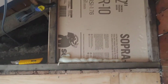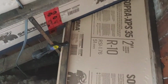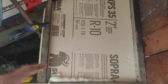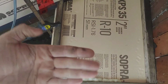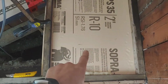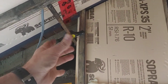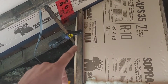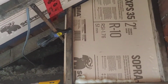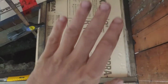On this outer wall, I have started up here. The last time I talked about, I put these structural members in, and like I said, I attached a piece of styrofoam to the back of the conventional 2x4. So I've got one like this in the back, which is glued onto the wood, and I've installed the second one on top. So I've got 2 full layers here. I've just got a clamp in place there. I put the clamp in to allow the foam board adhesive to stick to the wood. It probably would have been fine without, but I thought I'd set that up there, make sure nothing shifted. In my cavity, I've got room for a third, so I will add a third piece on there.